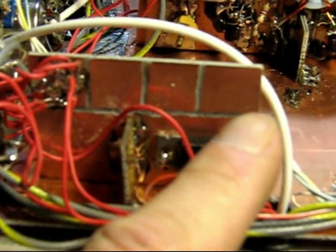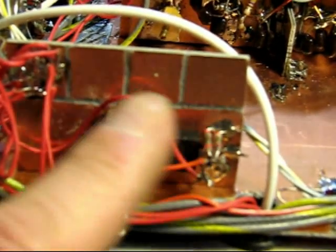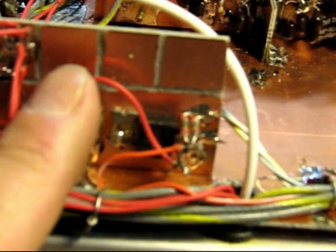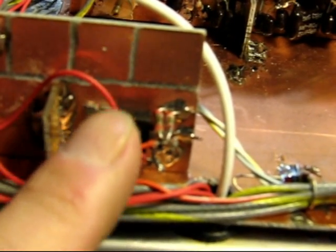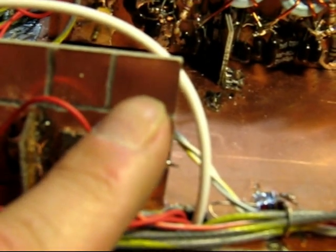Another tactic I use here is to dremel out a board so that I have little square pads for soldering — one for plus 12, another one. Here's an 8-volt regulator so I can have different supply locations. The idea was that if I got this into transceive mode, I could have a plus 12 receive, a plus 12 transmit with a very quick transition from ground to plus 12, and then a plus 12 keyed line using an integrator as part of a transistor — a scheme developed by Roy Llewellyn, W7EL — and maybe another optional line.